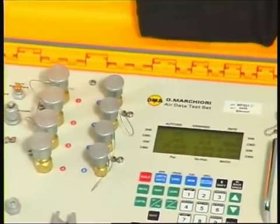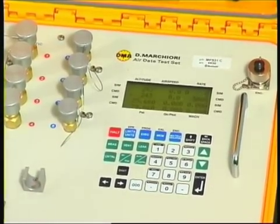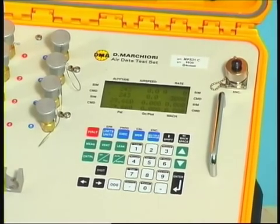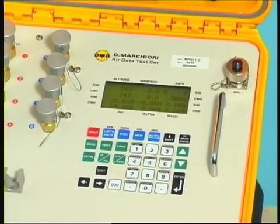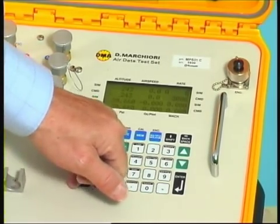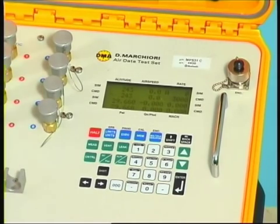The screen is fairly self-evident — we have a four-line LCD screen, and I will describe in detail what is available on it in a few moments. On this instrument we also have, as an option, an altimeter encoder connection. So if you are doing a test on an altimeter, you have the ability to take the connection from the encoder on the altimeter into the test set and monitor both the pressure to the altimeter and the output signal from it. We even have the ability, under the program key, to do this testing completely hands-free.